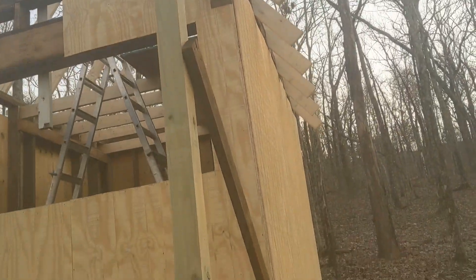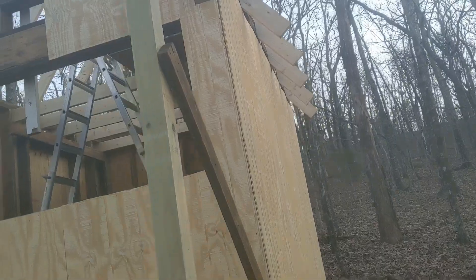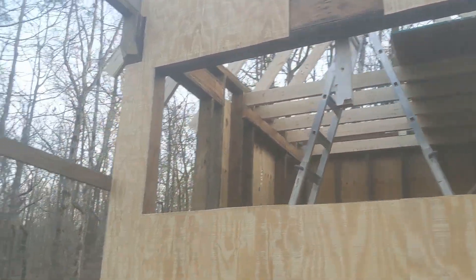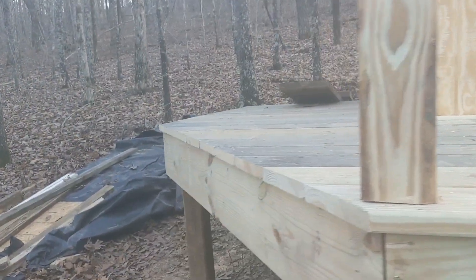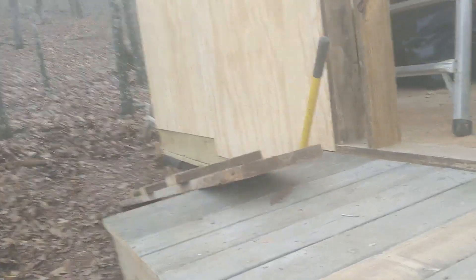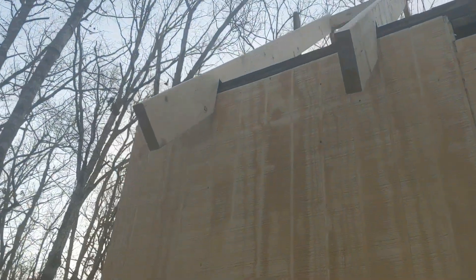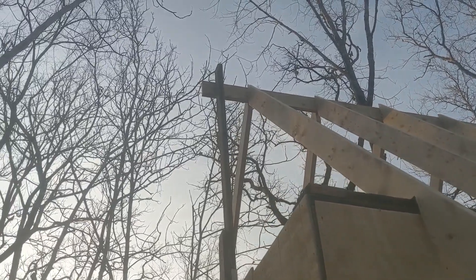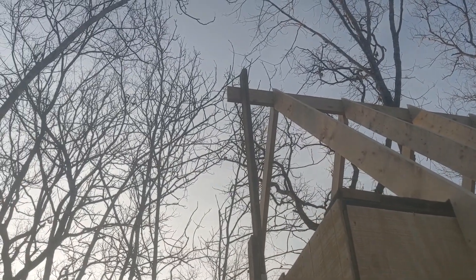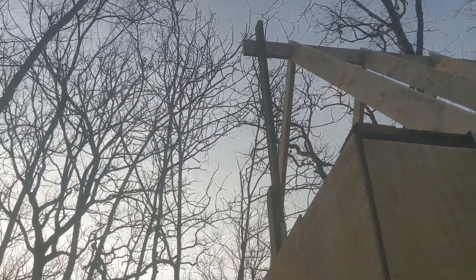Built my headers, the post and panel on the side. I've only cut out the one up front. This is kind of a spare-time project and I'm not going to be back out here till next Sunday. Still got to put the cap rafter on this side, and I still got to put my cross braces in for my eave, which will come out here about another foot overhang.